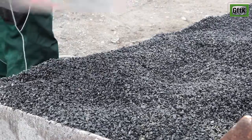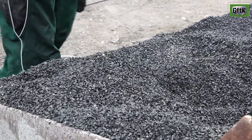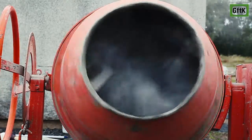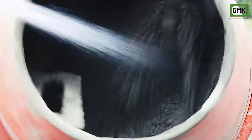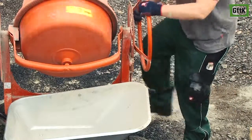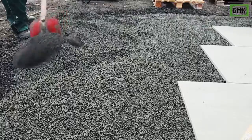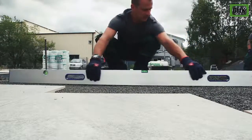To prepare the laying of ceramic patio elements in a bonded mortar bedding, a suitable aggregate such as basalt chipping 2/5 is required. For the binder we recommend VDW 480 bedding compound. Mix the chippings and the VDW 480 bedding compound to a bedding mortar until ready for processing. Depending on the estimated traffic load, a mixing ratio of 1 to 6 to 1 to 3 is needed, and with water an earth moist mortar is produced. The ready-to-use water permeable bedding mortar is now poured onto the surface and worked in according to local conditions. We recommend jointing from the highest to the lowest points.